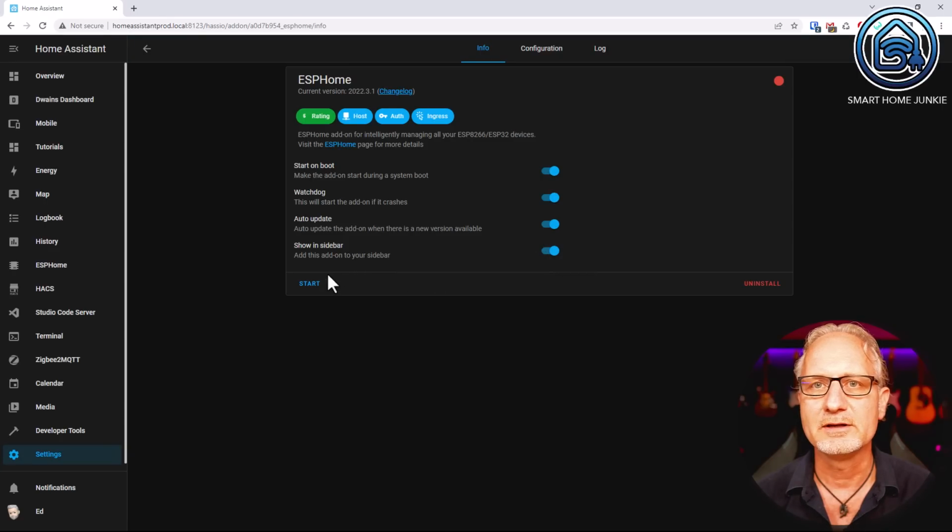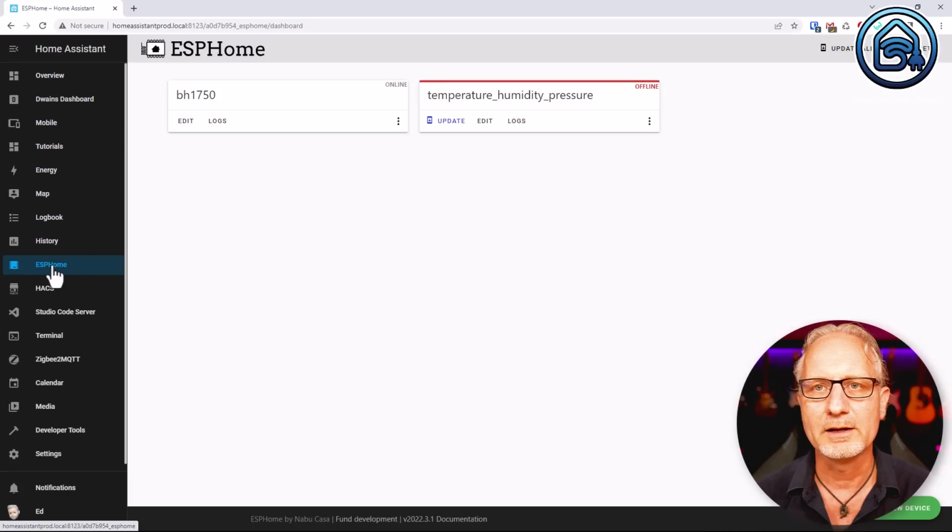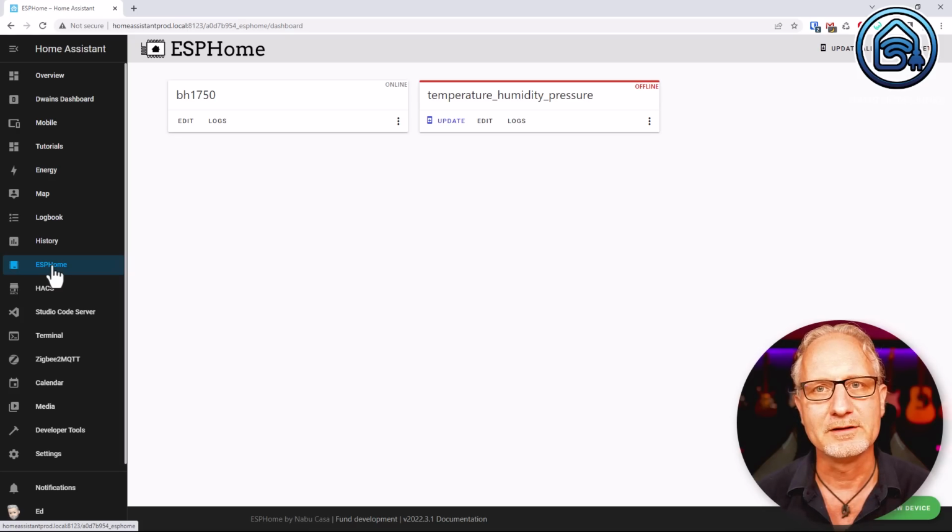You should see ESP Home in your menu bar on the left. Click ESP Home in the menu and the web UI will launch. You may get a 502 error. That means that ESP Home is still starting up. So feel free to try again after a few seconds. As you can see, I have already installed a number of ESP devices in my environment. We are now going to add the tag reader.